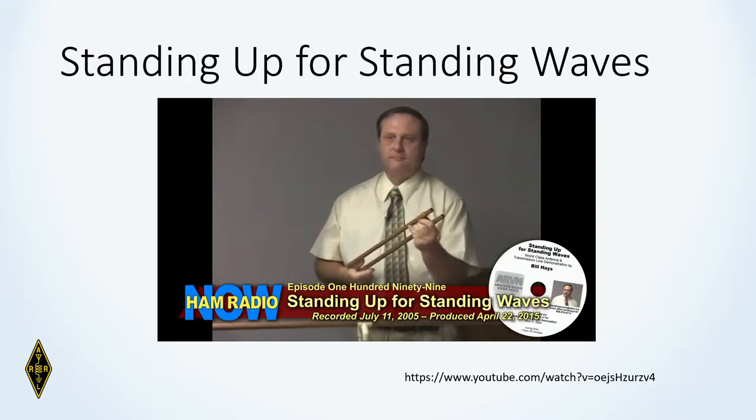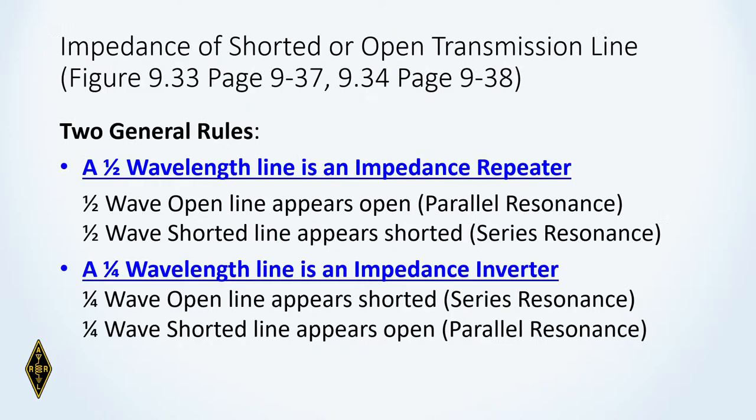Anyway, all right. How many of you got a chance to watch Standing Up for Standing Waves? I sent you a link with this video. If you haven't watched it, I really strongly urge you to watch it. Really some great information in this video. And two things that really stand out and that you want to know is that a half wavelength line is an impedance repeater. He says this and he proves it.